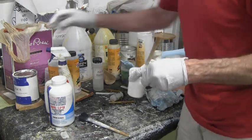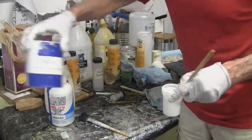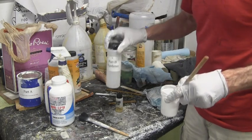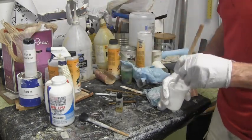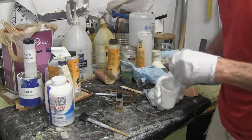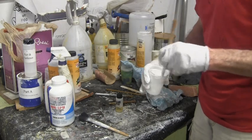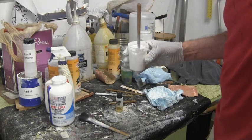This is kind of runny, but mystery paint A here is thicker, and you don't have the water to add and you don't have the cross-linker because it's already built into the hardener. It's much easier. I was going to put the last coat with that on, but I think I'll just go ahead and use up some of this LPU and save that for something else — maybe a daggerboard or whatever. Let it set, and I'll show you how I've changed my painting technique.